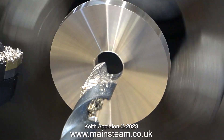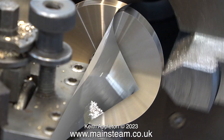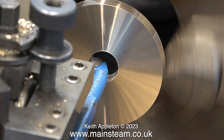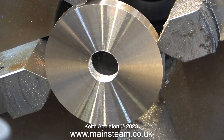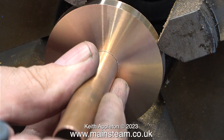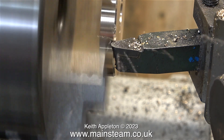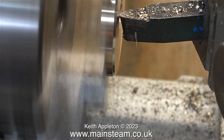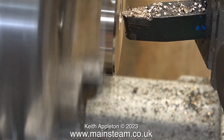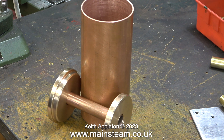Here I'm drilling a hole all the way through the part. The drill bit is very long and it wandered about a bit — it's a terrible job. But now the job is much improved by the final sizing of the hole using a boring tool. I'm not concerned with getting a perfect finish on the inside of the hole because all of this will be silver soldered together and there's enough room for the silver solder to get down the side of the flue. I'm using a round nose tool to chamfer the edge — this is the bottom part of the tube plate that is outside the boiler. The idea of the chamfer is to allow somewhere for the silver solder to build slightly and strengthen the joint.